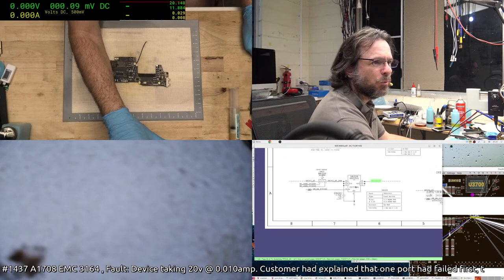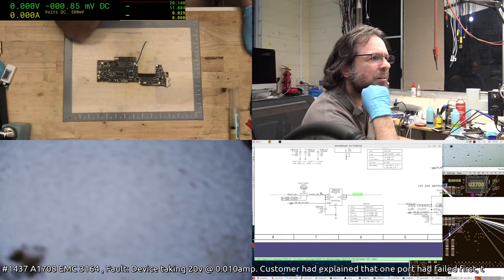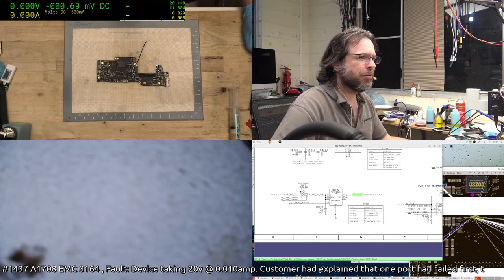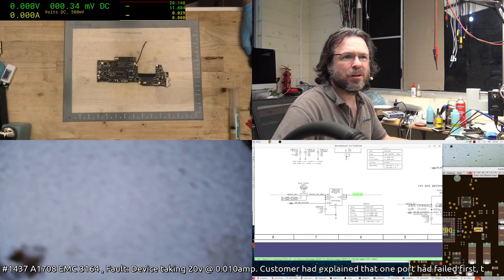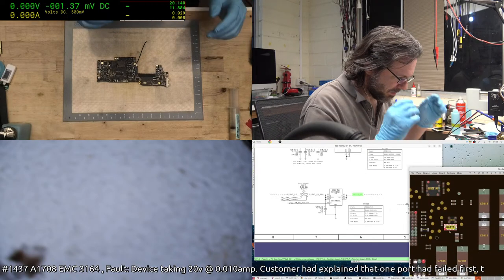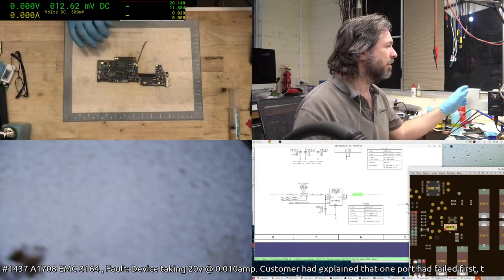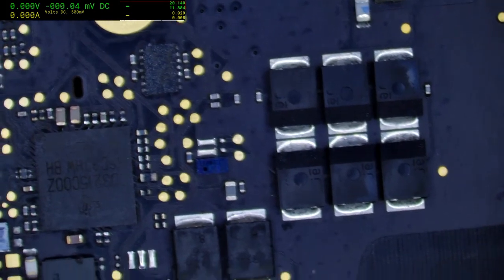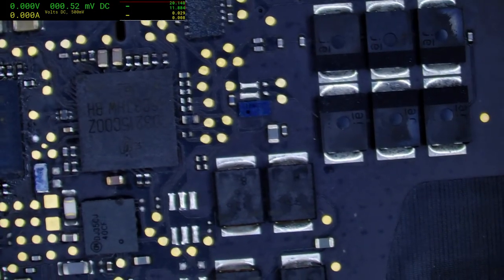And here we go, this is what we want. I guess the first thing to do is see if we have 3v3s5. So we have a look at UAD220, and interestingly enough, that is actually in the damage area. So it's this chip here, the blue glass one. I do recall having replaced that though. Anyway, we'll power it up and test the voltages.